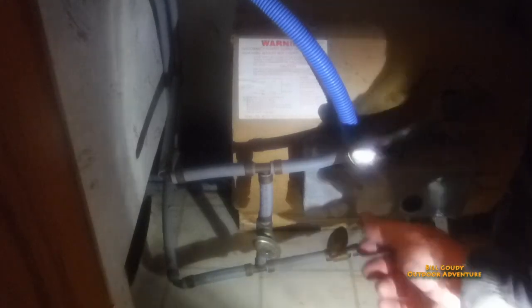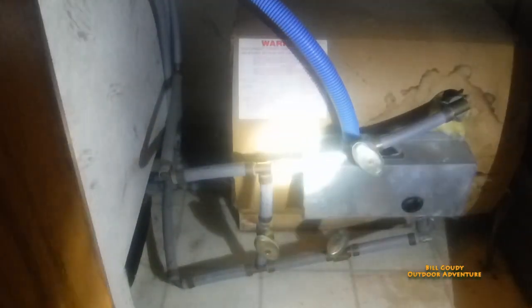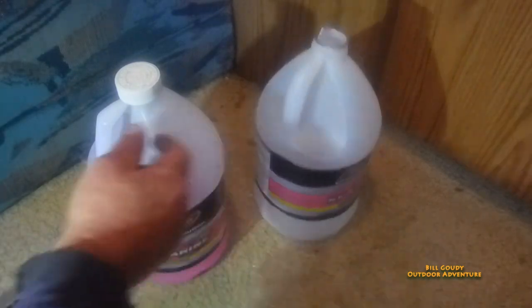There's one last thing I like to do before I finish this process. I shut this and I open this, and let pink stuff into this part of the line so there's no water that builds up in that — and that runs out to the water heater. Now I just have to worry about this right here. I open that line, then I open this bypass so now the water is coming up and going out, pushing any water that would be left in here. Shut that back off. Everything's good to go until next spring — then I open them back up. I used one whole gallon and part of the other gallon.